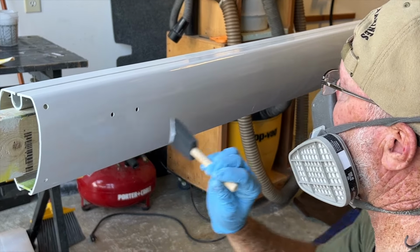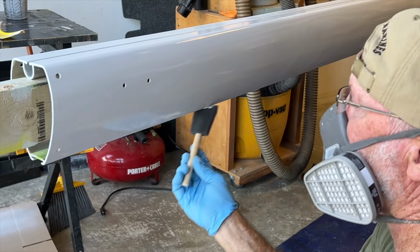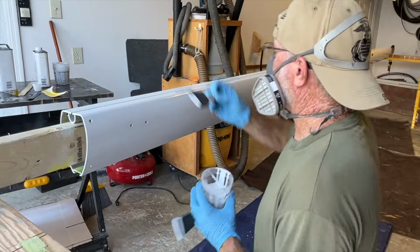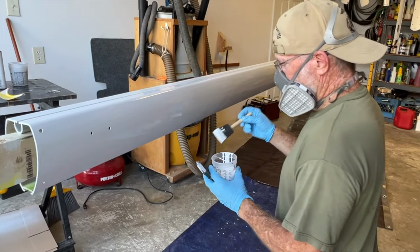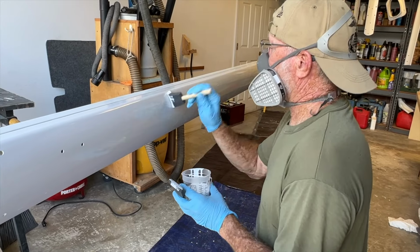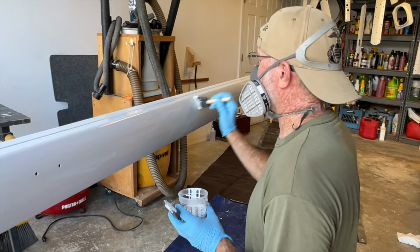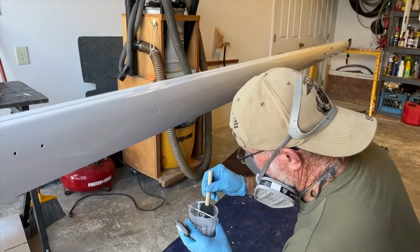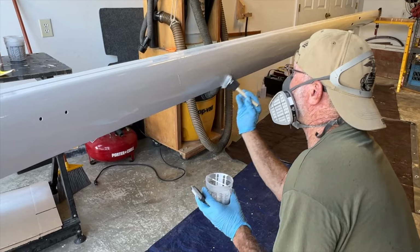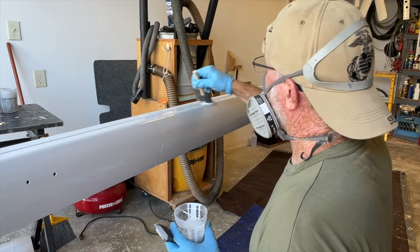And the technique I learned, make sure your tipping is light, you don't leave brush marks. I just say to myself, light as a feather. So you just use the one brush in the Awlgrip, because it will swell from the solvents in here and go bad about halfway down the boom. And then I take the one I'm tipping and I replace it and pull out another one for the tipping. So the tipping then becomes the brushing, and I just set the bad brush down.